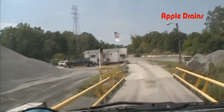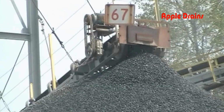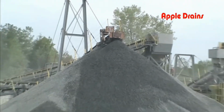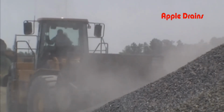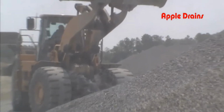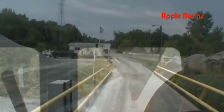One final note. If you're going to get gravel, especially if you are going to pull it in a trailer, make sure that your trailer and your vehicle are strong enough to pull that stone. 2 or 3 yards of gravel weighs close to 10,000 pounds. So you've got to make sure that you have a vehicle that's strong enough to pull that stone. Whether you pull it with a car or a van, none of that really matters. It's making sure that you're safe and you can get that gravel to your job site without any problem.